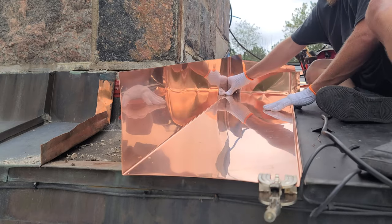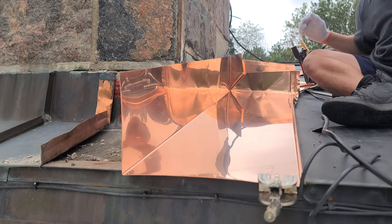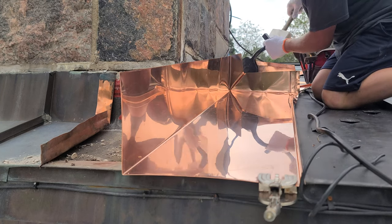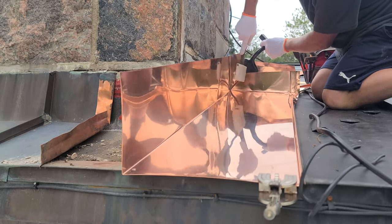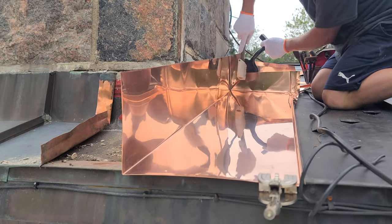It's sitting where I'd like it. This line is in line with the back pan crease, so we're in good shape. You can see the flange angle compared to the pan is 90 degrees, and once I have that at 90 degrees and where I like it, I hammer that pocket flat to lock it at that angle.